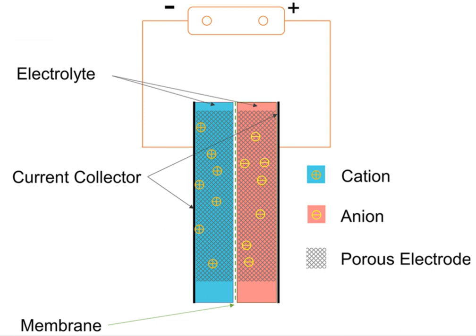Applications. Supercapacitors do not support AC applications. Supercapacitors have advantages in applications where a large amount of power is needed for a relatively short time, where a very high number of charge-discharge cycles or a longer lifetime is required. Typical applications range from milliamp currents or milliwatts of power for up to a few minutes to several amps current or several hundred kilowatts power for much shorter periods.